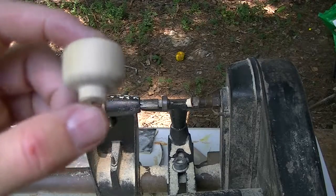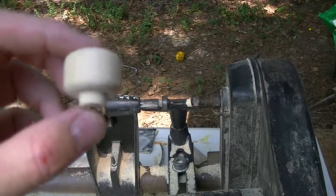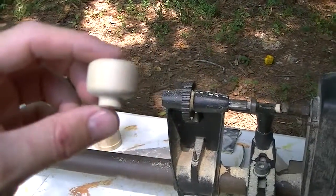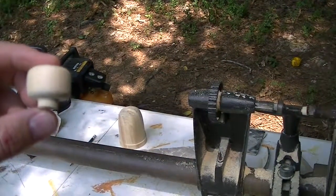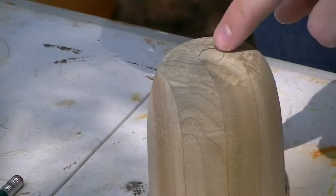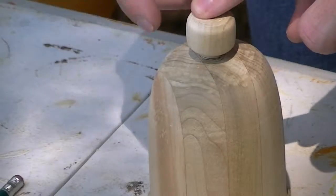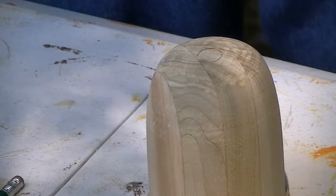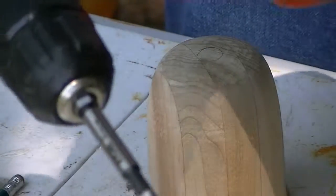As you can see, my little top is made, cut out and sanded. So now I get asked, how are we going to mount it to the top of the bell? This is how we're going to do it. First thing you need to do is center your bell top onto your bell and draw a little circle around the edge where you want it. Then you can take either a drill bit or, in my case, a forstner bit.